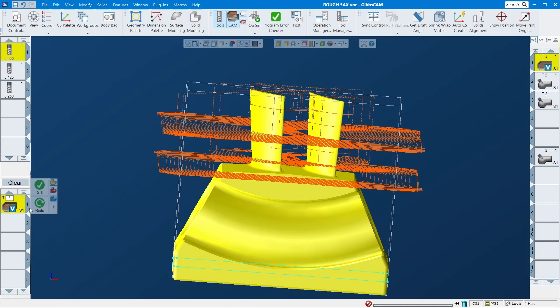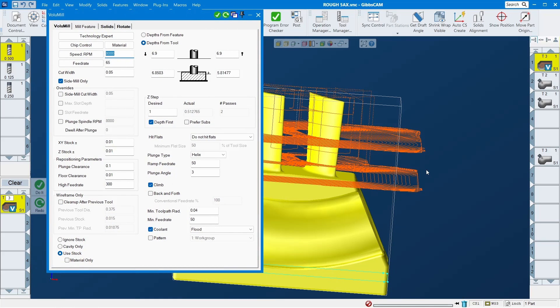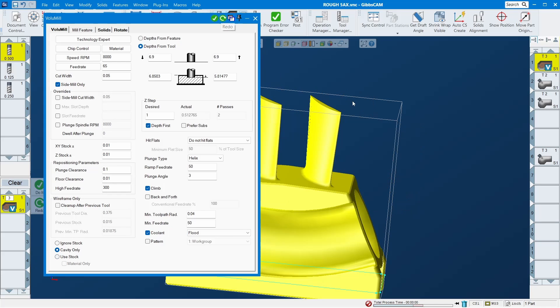In here, the three-axis toolpath doesn't go all the way to the bottom and rough this one out because of the option I picked. The tool is too big. But let me show you quickly how 3D Volumill works and then you can use it. When you use 3D, you can select the whole thing — the bottom of this will just be a mark — and then click somewhere over here and view this option right here. It works just like a 2D Volumill. Check here for Volumill, and 3D you check down here. Let's check the whole thing and see what it does.